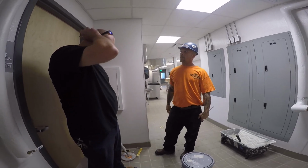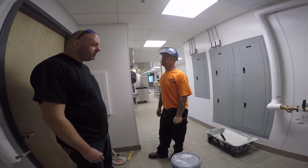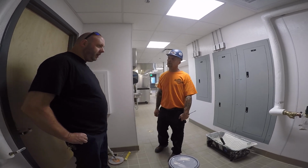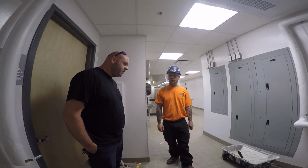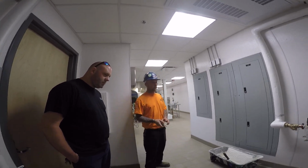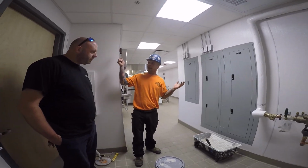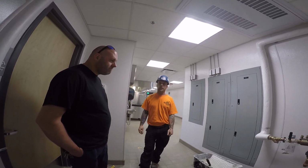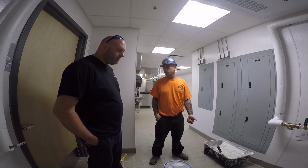Why did they put a pump? They didn't have enough volume? I don't know. Probably not. Although they have really good pressure here. It's like 72. The pressure here is probably one of the best I've ever seen. Yeah, 72 to 74 they have here. So I'm not sure what the reasoning was. It was a change on that. They added a pump. So probably they wanted more pressure for outside, I would guess. I don't think they typically put a pump in.